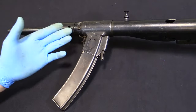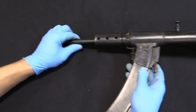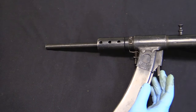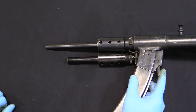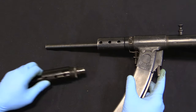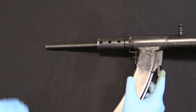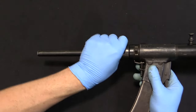You need a .30 calibre barrel with a 7.62x25 chamber instead of a 9mm barrel. With these conversions — and this is normal for all of them — you'll find that they actually added a substantially longer barrel. The 7.62x25 barrel is 10.5 inches long, which is quite a bit more than the original standard Sten barrel. The Tokarev cartridge does benefit from a longer barrel, so that may have been on someone's mind when they developed this.